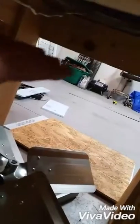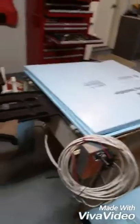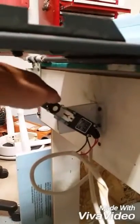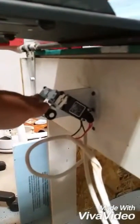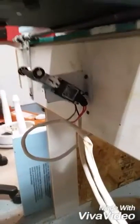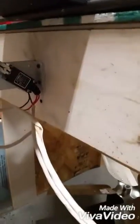The fan's going to be mounted up in here and it comes down to these actuator switches. So when the door opens, this weighted plate — see how I weighted it there so the door doesn't weigh too much for the actuator — will open up, it'll click these two switches, bring it down, and that turns on the fan. So the fan will not come on unless the door is open, which is kind of a safety measure.